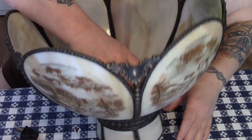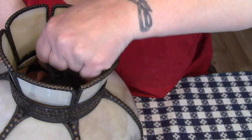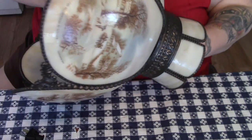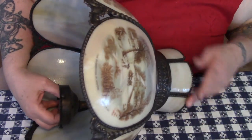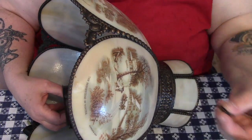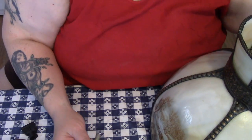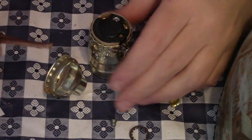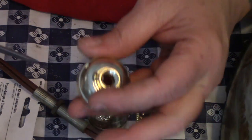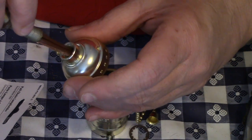Alright, let's get started. This lamp used to have a globe on it — one of those white globe things. We're just going to take this knob off, and the nut that should be holding this all together, and this should just unscrew from the cross piece. Here's our knob that our chain is going to be attached to, here is the nut and the little washers, and here is our threaded bar. We have to take this part off the threaded bar so that we can put the threaded bar onto this piece. Now we've got our wire through, and we're going to loosen this little screw here so that it does not impede our rod in any way.